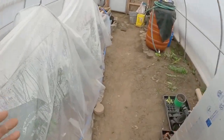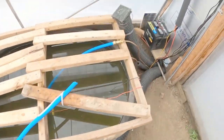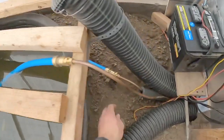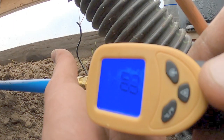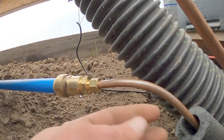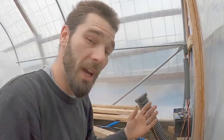That's all thanks to our compost heating system. We're pushing about 100 degrees, running pretty constantly. I had the water shut off because it was a very cloudy day. I'm picking up about 89 degrees on there — it's really hard to get a reading. I almost burnt myself at first because it was a very hot transfer of heat, then it slowly dissipates. We've got a hundred feet of quarter-inch copper coil running through that pile, though it's around a pole rather than spread through the whole pile. I think next year I can pull higher temps if I change up the system, but we're in good shape — at least 100 degrees plus coming out of that.